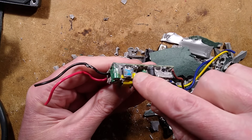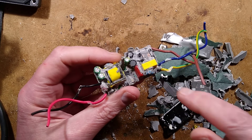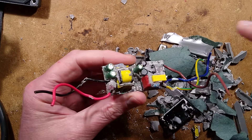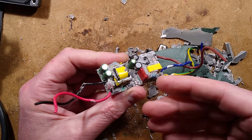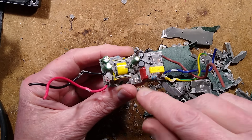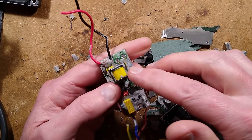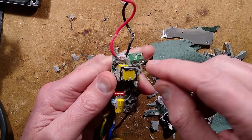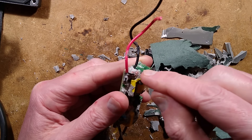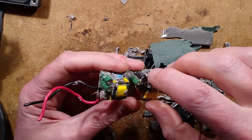What it's revealed inside is quite spectacular. The earth wire is active — it's connected to a Class Y suppression capacitor to the negative of the circuit, and there's another one going between the primary and secondary. There is a common-mode suppression choke, a Class X2 filter capacitor on the input, and a little bridge rectifier tucked under there. But it is power-factor corrected — it's not just straight smoothing. This little chip in here is a BrightPower chip and it's riding the full-wave rectified sine wave.